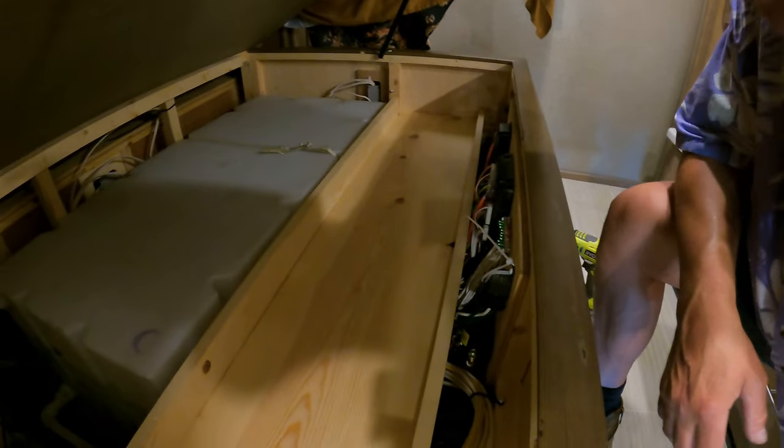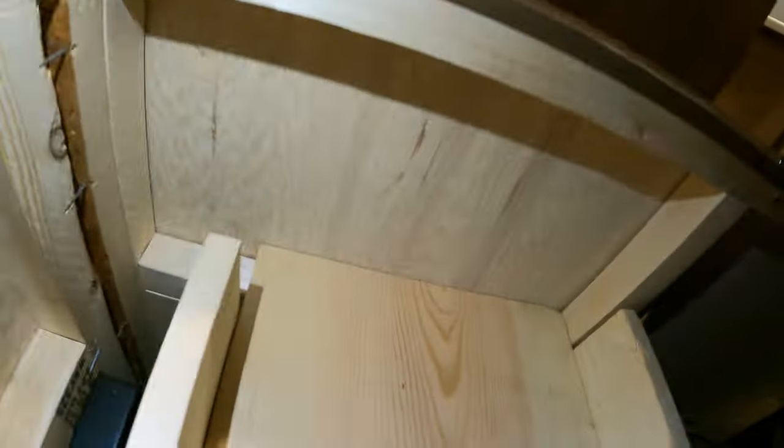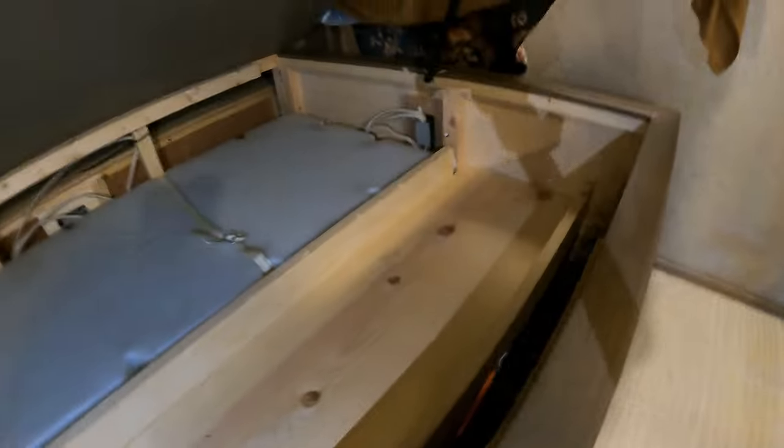I forgot to start recording — I was so caught up in my project. I've got the shelf installed. What I did was I put in some little stiff legs, put a little block down there in that corner, and then I have a saddle block sitting on top of that. I did the same thing on the other end, so that way we have a support for the 1x12. I went ahead and put the 1x4s on the side — it's probably overkill, but it's better to have a little strength than none at all. It'll keep it from sagging.